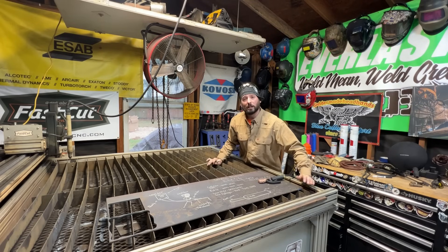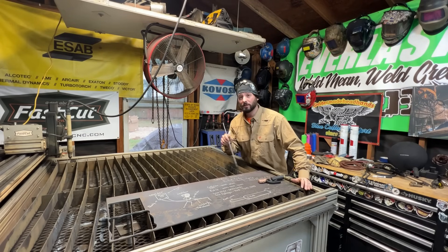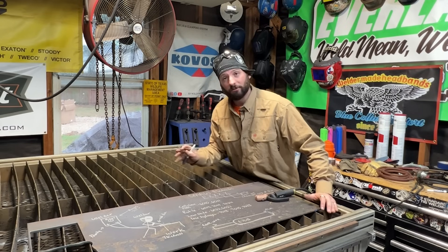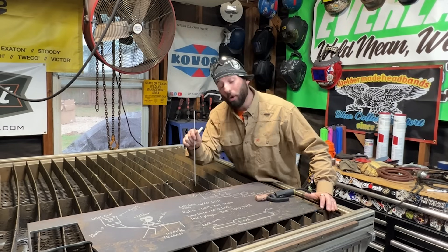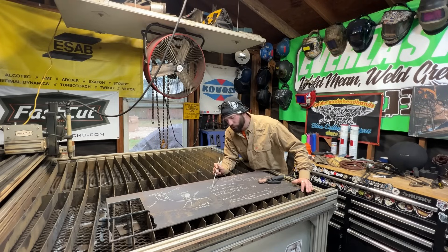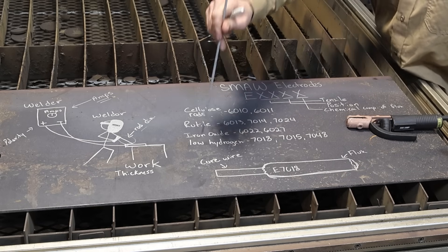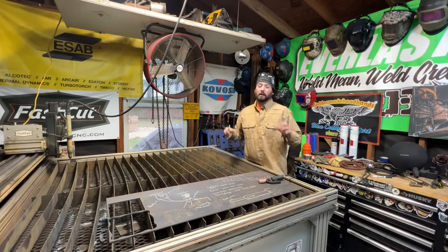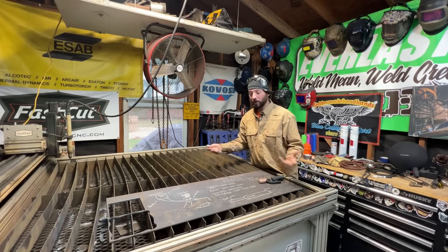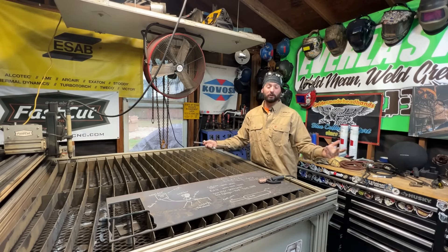There are so many different types of stick welding electrodes out there, and we're not even getting into the different alloys of carbon steels - low, high, medium - different stainless steels and aluminum. This is only scratching the surface. Rutile rods are your general purpose electrodes and strike up - oh my gosh - so easy, you don't even have to try. Whereas cellulose rods can be a little bit more stubborn, and low hydrogens even a little bit more tricky. With all these rods being different from each other, they run a little differently, and it even comes back to how the welding machine wants to weld.